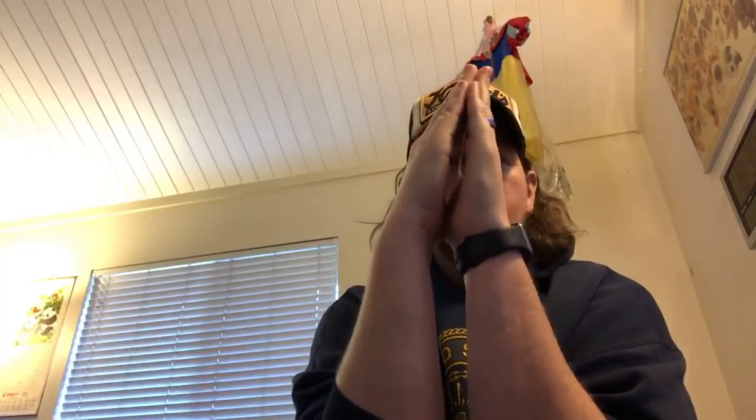If you have an edge that's canted over at the edge, but the blade is still straight, so you see how my arms are straight, but the edge is like this? When you put it in, it's immediately going to hit that material and start to roll more in the direction of the incorrect angle. And it's just going to cause it to roll and peel off because it's not a good aligned edge that's going to go through the material straight.